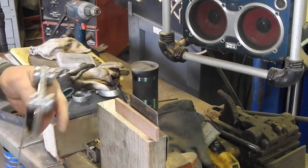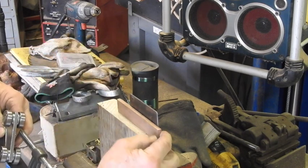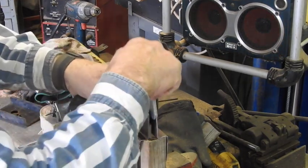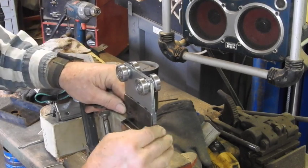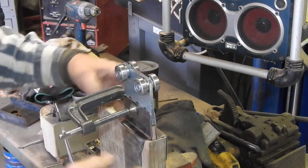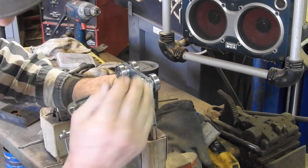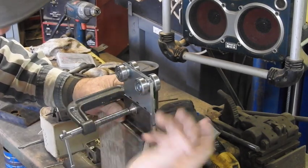Well, I say a jig, but it's not really a jig — it's nothing more than a spacer that'll hold the rollers at a level that I need them to be held at. It's going to sit in between the two halves of the supports, so those will sit on there like that. This will go in the middle right here. That way, every single one of them is going to be the exact height that I need it to be, because the height off of the floor is very, very critical. I just merely clamped this in place. With these flanges sitting down on this right here, I've got two different widths of the mounting so that it'll give me an adjustment left to right. If I need the door to be farther away from the wall or closer to the wall, all I have to do is invert the hangers.